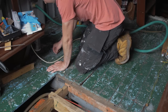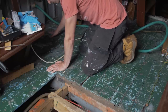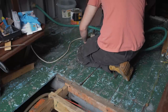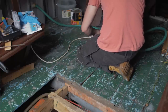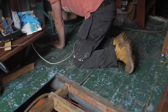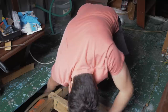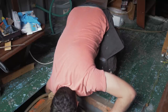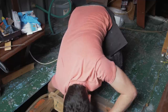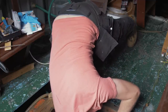I noticed there was an issue with the bilge pump in the engine room. Every 2.5 minutes it should knock on and pump any water, but I noticed that it wasn't making any noise, and this was the next day, so it must have happened during the night. So a lot of water built up in the bilge, as you can imagine, but nothing alarming, thankfully. So we have a small leak in the engine room at one of the outdrives at the transom. We're not sure if it's the actual bellow at the transom between the outdrive and that, or if it's due to rotten timber.